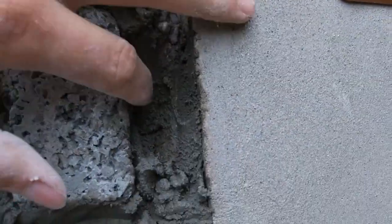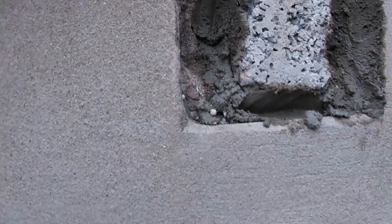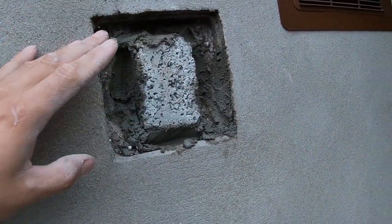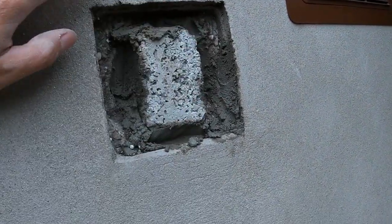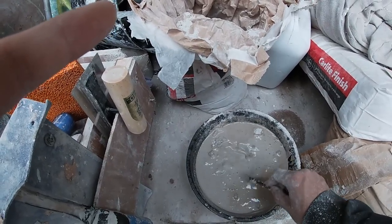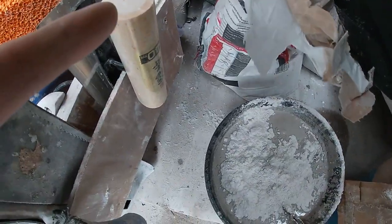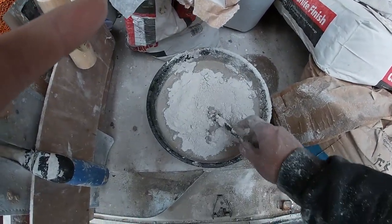Here's a close-up and you can see how well I've got it tucked in there. No chance of this brick ever coming loose. I've just checked everything is in behind. You might want to do it over two days — let it set up, put a scratch coat on, and come back. I've put a wee scratch on it, I'm going to let it pick up and go ahead and do some snagging work on the inside. If you have something else to do or a tea break to take, you can look at your phone for half an hour, eat a sandwich, or have a cup of tea — you've got to keep on working.